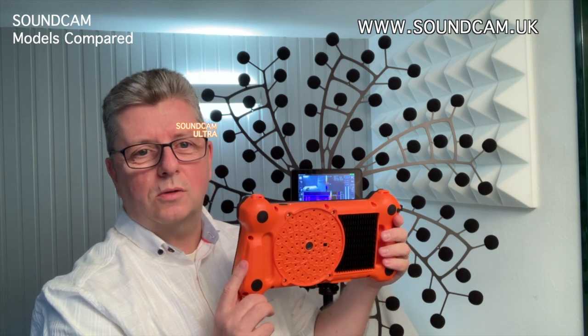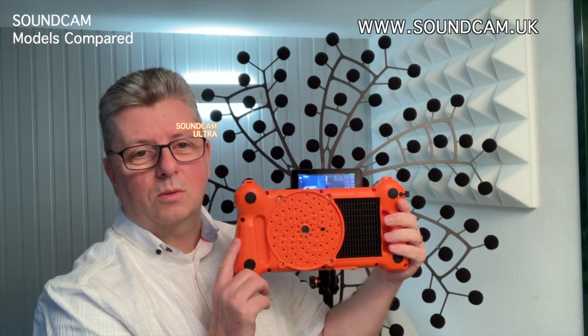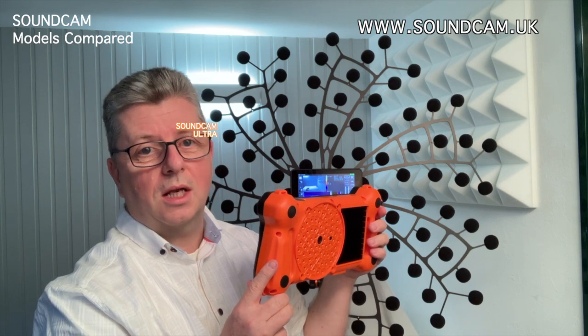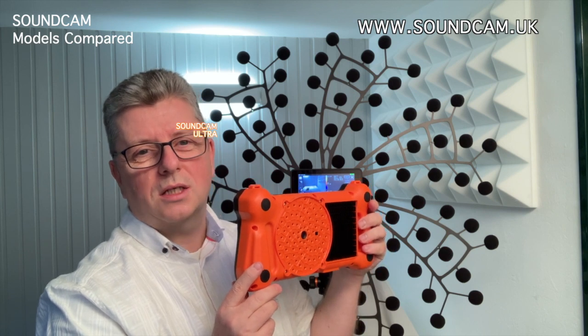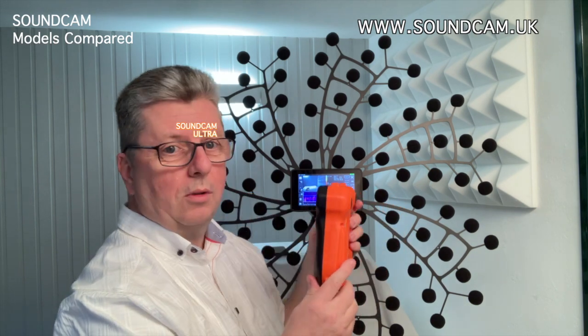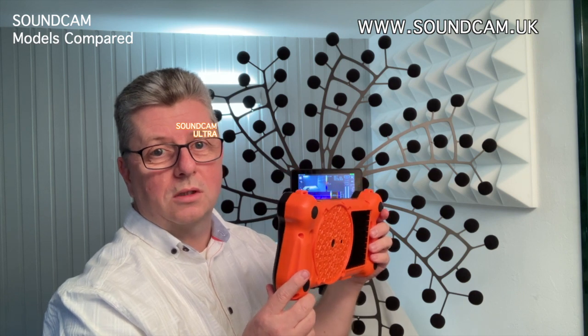But what this guy is good for, actually we've got somebody looking at bat movements and stuff like that with this as well. But what this is mostly used for is finding leaks, gas leaks. So if you've got compressed air in your factories, running miles down your factories, gas leaks in gas distribution systems, whatever, you can wander about the factory and find these really fast. You'll see them from 30, 40 meters away.